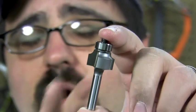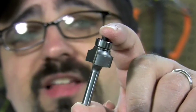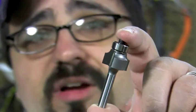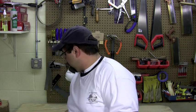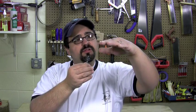So next we're going to zoom back out and talk a little bit more about actually using the 1/8-inch round-over bit. A round-over bit is a round-over bit — one thing they do extremely well is break down the surface so you get that nice convex shape. It gives us a really beautiful edge detail because sometimes you want nothing more than just a simple little roundover. One reason we like roundovers on our edges is that it really helps the light break just right on it. A nice square edge just looks too square, and the light won't dance off of it the right way.